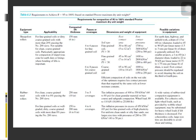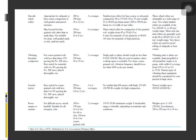For sheep's foot rollers, rubber tire rollers, smooth wheeled rollers, vibrating base plate, crawler tractor, and power tamper or rammer, you can see in the table the applicability for each soil type, compacted lift thickness, number of passes or coverage, dimensions and weight of equipment, and possible variations in equipment. Depending on the equipment type and applicability, you will get the required relative compaction R of around 95 to 100%.